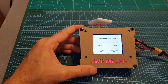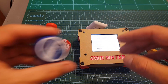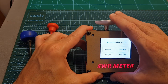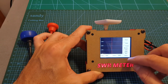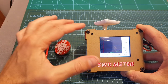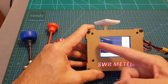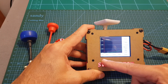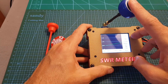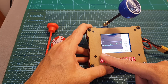In my upcoming comparison video I'm going to compare the PokerChip and Pagoda antennas with the ImmersionRC SpiroNet and the iBCrazy Mad Mushroom antennas. I'll run more tests to find a frequency that is ideal for all four antennas so the comparison will be fair. From the SWR data, the best frequency for the ImmersionRC SpiroNet is around 5.7 gigahertz, and for the Mad Mushroom antenna the values get lower closer to 5.64 gigahertz.